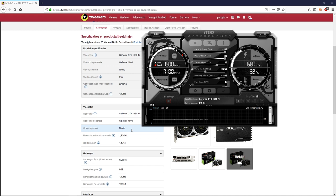Honestly, what is the point of water-cooling? You will see it won't even get past the 60-something degrees. The power limit really limits what you can do. As you can see, it does not go above 100%, so that is about what you can get with this card. Core voltage is slid up to the max, although again it is very limited power-wise. Temperature limit does not matter because it will never even get close to that, even on the harshest benchmarks.